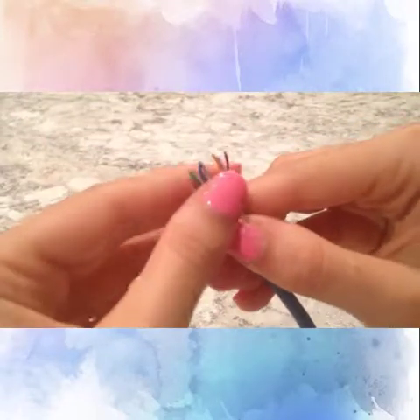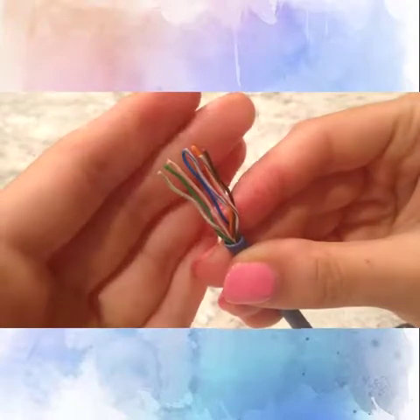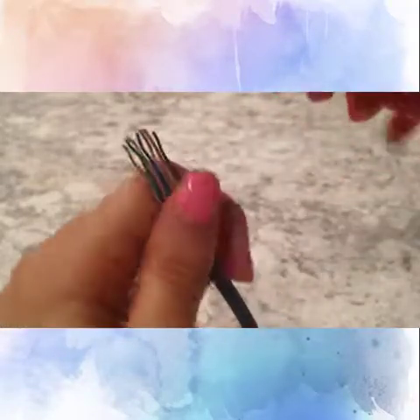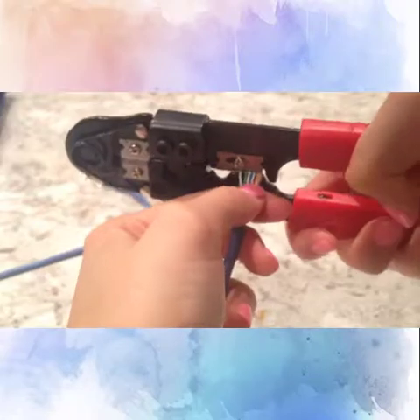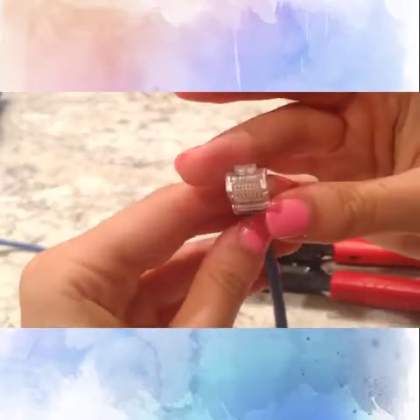I shift around the wires to match the correct order as just mentioned. I roughly twist the wires forward and back in order to straighten them further. Once I completely have the wires in the correct order and fairly straight, I then trim them straight by lining up the wires as evenly as I can and cutting through them to have a straight end. I do this so that when I insert the wires into the connector, they will be able to connect with the metal piece at the end, therefore allowing electricity to be conducted between the wires and the outlet. Once trimmed, I then line up the wires in the connector and gently glide them through, being careful not to incorrectly move the wires around before they hit the end.